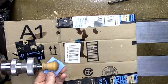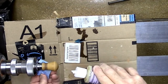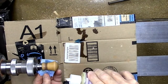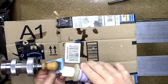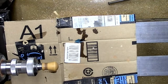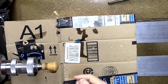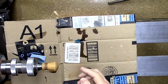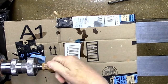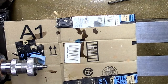And this is Craft Supplies woodturning oil. It's all I do. Put a couple coats on, wipe it off, try not to make too much of a mess that woodturners usually make, and then that's it. And then if you saw on the website, I have a little hanging thing that I would go sit and hang for half a day till after lunch, and I would then buff it out. And I'll buff these out tonight. But that's why I love olive wood.